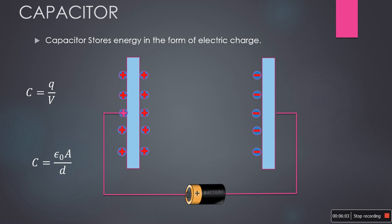If I still want to improve the capacitance, I am introducing a dielectric material — a pure insulating material. What happens then? On one side, negative ions will be induced because of the positive ions on the first plate, and on the other side positive ions will be induced because of the negative ions on the second plate. Effectively, the separation between positive and negative ions is reduced. Let's say this distance is 10 centimeters — in the earlier case, the positive ions see a negative charge at 10 centimeters, but now this distance is reduced to 1 centimeter. So the capacitance is improved by 10 times because of the reduction in effective distance.